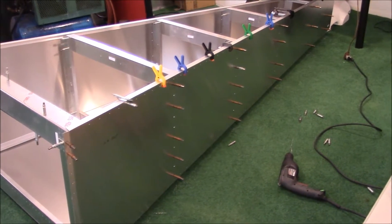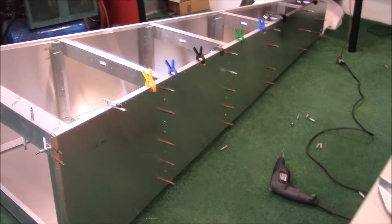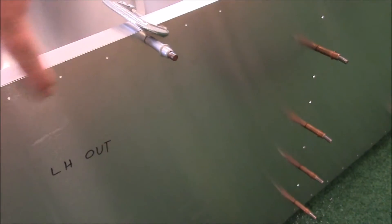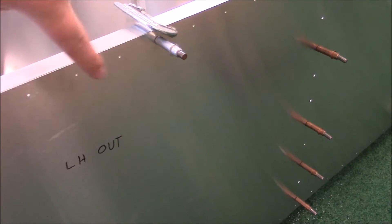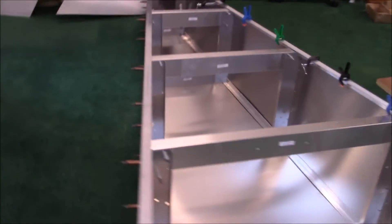Not necessarily a boring job, but a very monotonous job. I went and drilled up all the side panels to the 40, minus the top row here. They want you to keep this at a 30 size, because when you attach the turtledeck later, then you'll drill both of them up at the same time to the 30 size. So I did both sides.